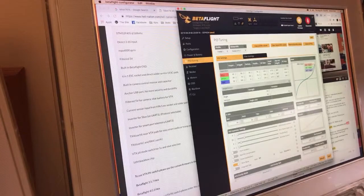So, let's see. Does the Talon come with any kind of wacky? No, it's Betaflight defaults. So we'll just drop rates in first. I run the weirdest rates you've ever seen, but it is the best way that I've found to soften the center stick up to the point where it looks like the gimbals don't make that notch in the middle, where the one spring stops and the other spring begins. That's an extremely low RC rate, because that's the only one of these that specifically affects dead center of the stick travel. And then zero expo, because I want to dump that RC rate down as low as possible to focus on the center of the stick travel. The expo pushes the middle of the stick travel around here, and I don't want to do that.